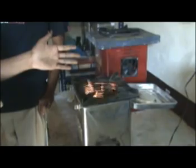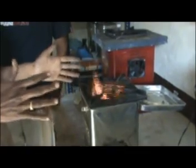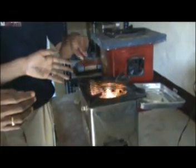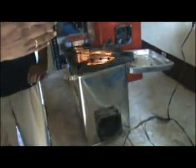Now the fan has been turned back on and the combustion reaction is starting again. In this particular model it is not preferable to turn off the fan. This is wood gas burning — the white color smoke you saw is nothing but wood gas, because it did not get sufficient oxygen it did not combust. Now because of the fan we have that extra air and turbulence, and that is combusting.